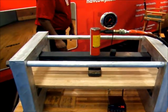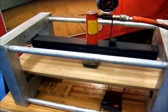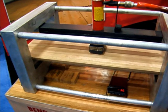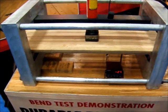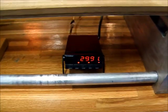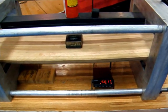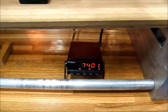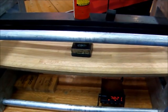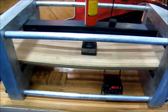So normally you'd still have the wood on top but the composite would be underneath on the real trailer. We should be able to exceed 8,000 pounds real easy. We cracked the other one at a little short of 5,500 — we're already well past that. Starting to crack. Just shy of... yeah, we just crossed 8,000 pounds.